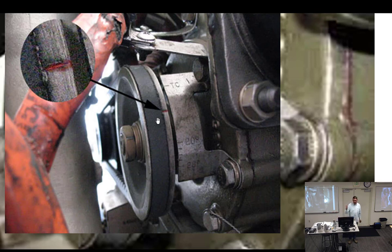So you go around, you pop out the number 1 spark plug, put your thumb over it, you bring it around. Oh, yep, it's on compression. It's definitely on compression. Look at the back of the engine. You stop, you bring your prop around until this is right there at top dead center. And then you bring it around, back it up, and you go, okay, I want it right there at 28. Bring it right to 28. Throw your mags on. Set it up with your timing right. You're perfect. You never really stop to verify, is the piston at top dead center when it was at top dead center? It's not, because you're off by a couple of teeth, but it was so close that you didn't notice. So say instead of putting it at 28, you really put it at like 34 degrees, 36 degrees before top dead center.